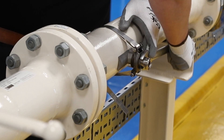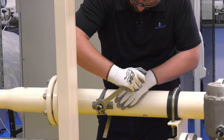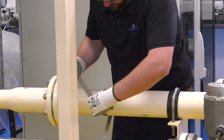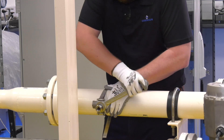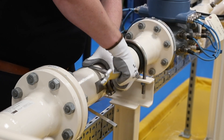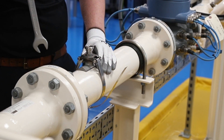To adjust the universal pipe mount assembly to its desired location, use a 24mm spanner to tighten the tension nut located above the tensioning plate. Tightening this nut will compress the central spring further, lifting the mount foot and loosening the pipe clamp assembly, allowing it to be moved and positioned into the desired location.